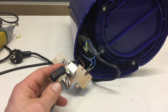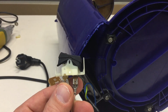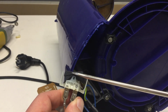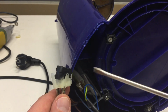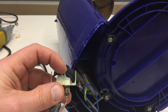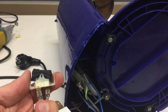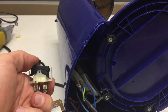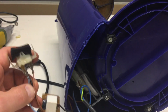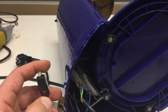So that was the most evil snap-in, and the snap-in actually was here in between, and that recess, and two little tabs, so it wouldn't be visible from the outside, and the switch only held basically near the axis of rotation wouldn't wibble wobble. They have these two arms coming out from the inside, pressed against the case. And you might wonder, why are there neutral and two phases? That's because that switch has an indicator light built in.